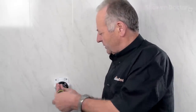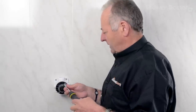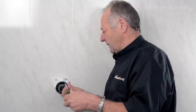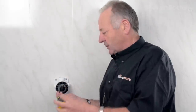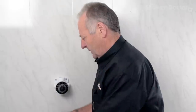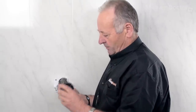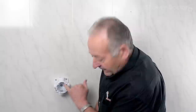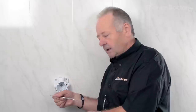Out comes the cartridge. At the back of the cartridge there's an O-ring — this O-ring is particularly difficult to get into. Here's the old cartridge. Right at the back there is an O-ring in there. To get the old one out you use something like a crochet hook or something pointy that you can stab the old one with, hook onto it, and get it out.